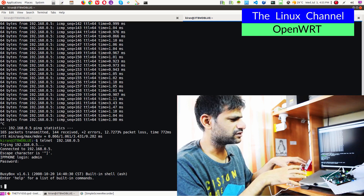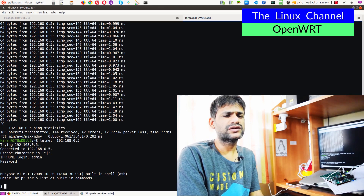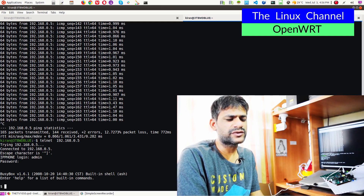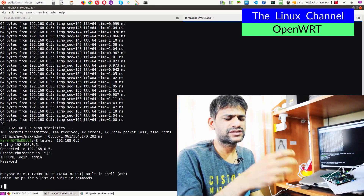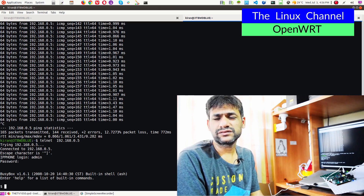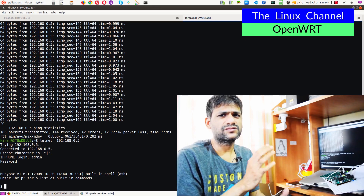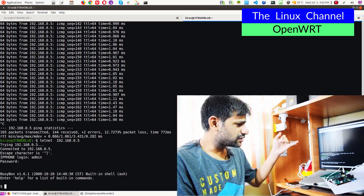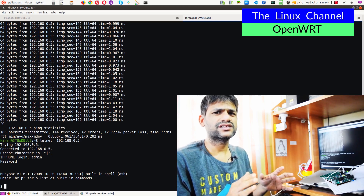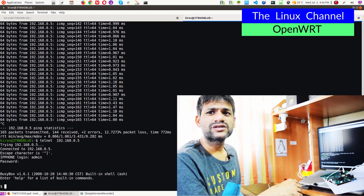The main important thing is the kernel should work on such type of boards. This is what I often say — if you are going to become a platform-level developer, most of the time you will be working on things like this where you work on the core operating system or platform-level work, porting and doing board bring-up. You need to be very good in operating systems and fundamentals, as well as analyzing problems and porting the overall working operating system. If the board is a low-configuration board, you need to strip down all the features of the Linux kernel and make it small enough to fit.